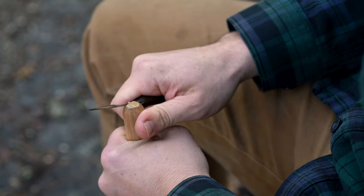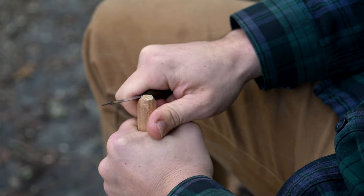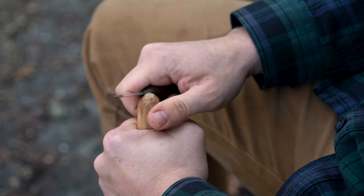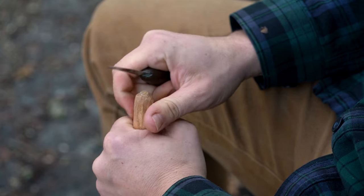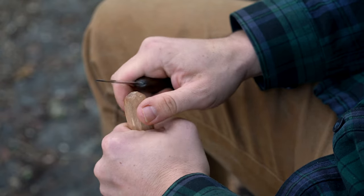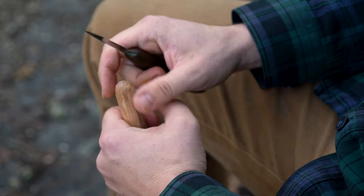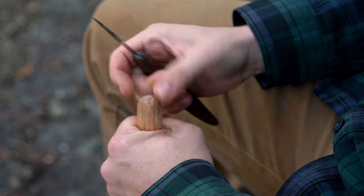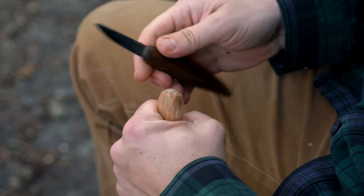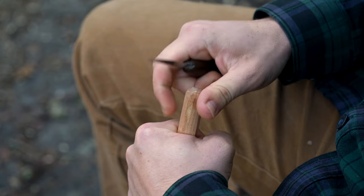You just kind of make your way around and set your knife where you want it, squeeze your fist closed, and just do a small little cut, rotate the piece, small little cut, rotate — nice and easy. You'll see it's not coming close to my thumb at all. This is really more useful on end grain or the tips of spoons or rounding off end grain. You get a lot of the same effect as with the little push cut, but every now and then it's more handy to come at it from the other way. So it's good to know how to do both.